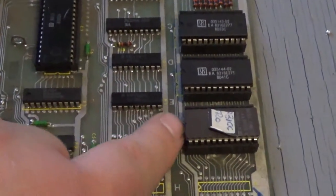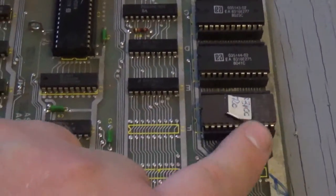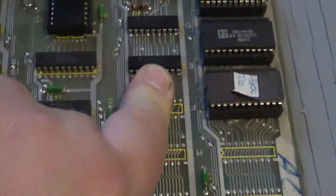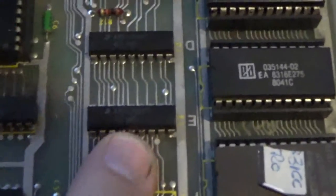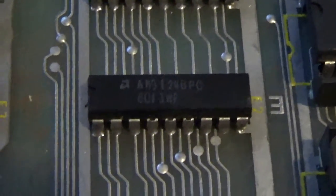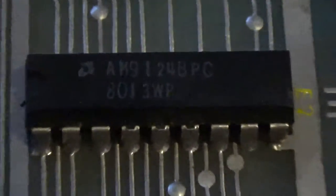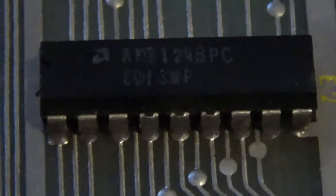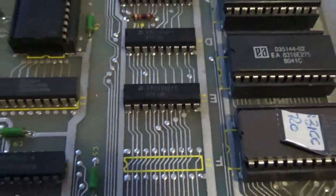So I know that E2 — bank 1, position 2 — is the chip that's the culprit. I happen to know these are 2114s. Even though these say something else, it's a compatible chip. I don't have 9124s, but the 2114 is the same exact compatible chip, so that's what I'm going to put in.